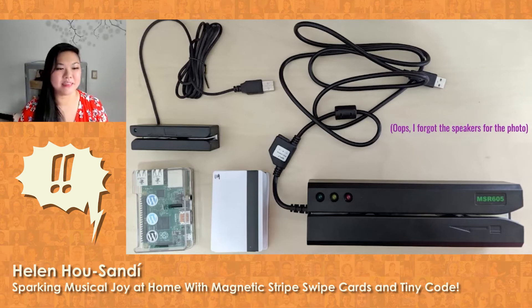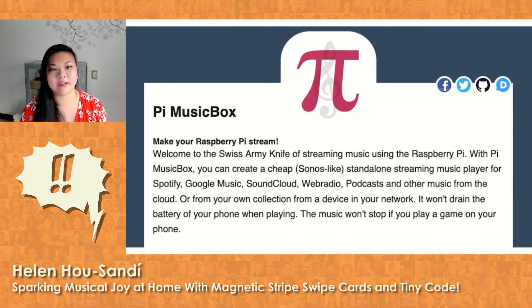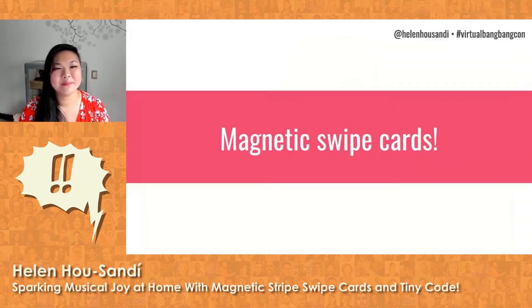I collected everything and started testing components. First was making sure I could get Spotify playback on a Raspberry Pi at all — I have no idea what I'm doing. After a bunch of Googling, I decided to do this using Pi Music Box, which was super easy to install and get set up. I actually probably took longer trying to find a USB keyboard before realizing that a wireless Apple keyboard works just fine with the cable plugged in. And now the next part: making the cards work. My idea was to put Spotify URIs on the cards and have that trigger playback — enter Spotify URI and have Pi Music Box start the track. USB card readers are basically keyboard emulators. You swipe the card and the data is sent to the computer as though you typed it super fast. I plugged in my card reader and swiped an old bank card just in case it was trying to steal my data.